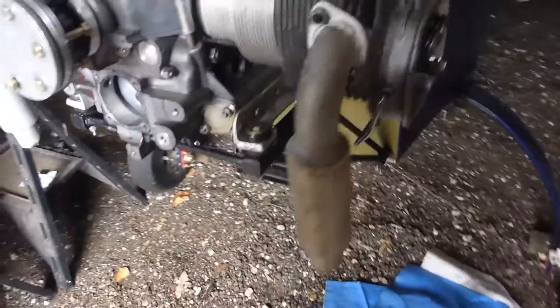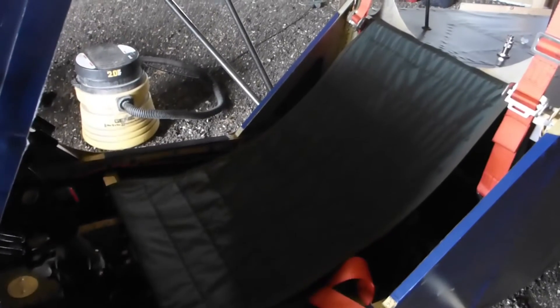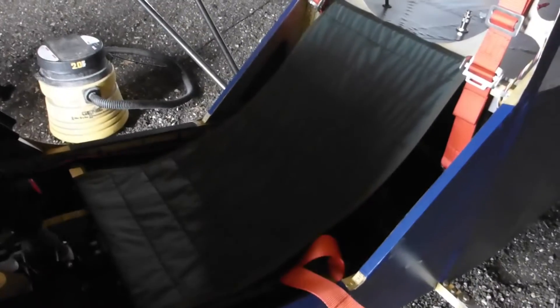I put in a new sling seat. It's a little dark in here, but the seat that comes with the Ultra Cub is just a flat aluminum sheet — a piece with a hinge that comes up, with a seat cushion. Technically, according to the plans, that little box underneath is the seat, and the other piece is excess material. I found that seat was just too uncomfortable; after about 20-30 minutes my back would start to hurt. So I'm trying this out — it's ripstop nylon, stitched on the edges. I might add some longer reinforcing pieces across it.